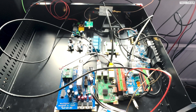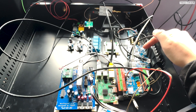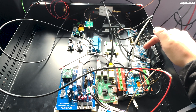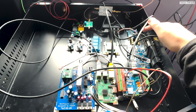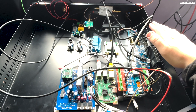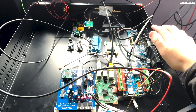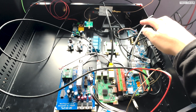There's quite a lot going on here, so let me explain. Over on the right-hand side, I've got a Pluto, which is going to be used for transmit on DATV — for transmitting digital television. That then goes into the preamp, taking it up to about 18 milliwatts, and then there's a connector on the back of this 2U empty rack chassis that I purchased. It was quite expensive, but about the right size for everything. So that's the transmitter side of things.